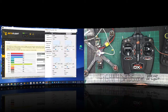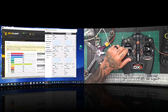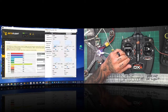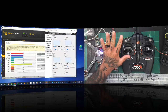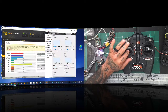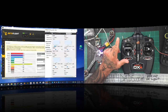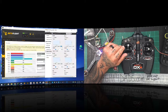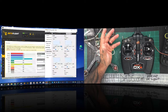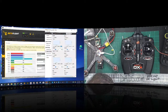Here's my throttle stick. I'm going to go to 150 on the max and 150 on the min. I'm going to remove the link — the link means that every time I raise one I lower the other in equal intervals, and I don't want that. So with the link removed, my minimum throttle value is 988 and it needs to be at 1000. I'll keep dropping the minimum, but note that every time you adjust it, it's going to lose connection momentarily, so give it a second. I'll drop the maximum down to around 2003, then 1999.